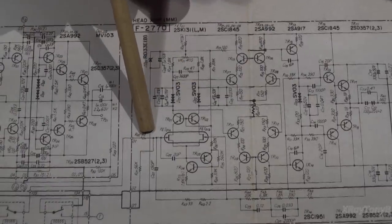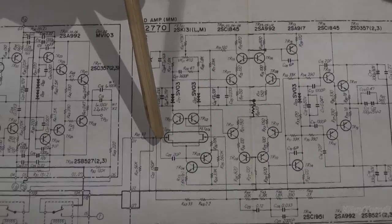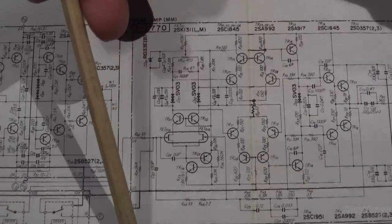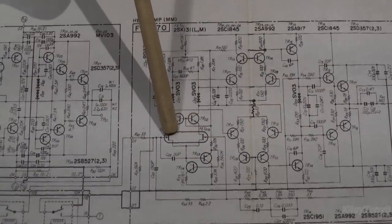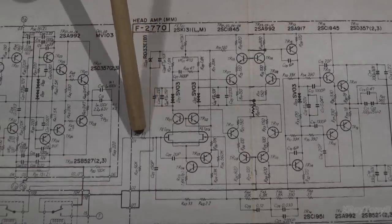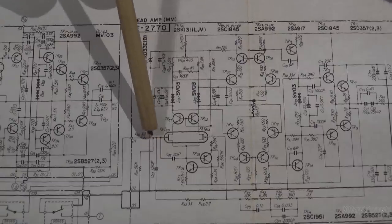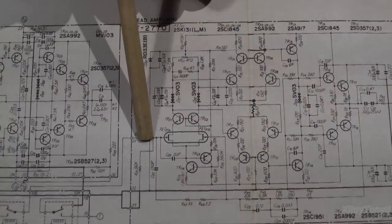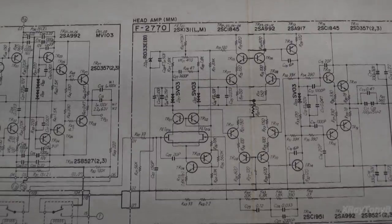What this is trying to do is eliminate the need for that by using this, which can actually be positive feedback just as much as negative, I believe. And therefore, no matter what kind of cartridge you put on this, whatever the output impedance of that cartridge is, because most of these moving magnet stages are typically designed to terminate at around 47K ohms, 47K, I believe. And this doesn't really care. It will adjust to whatever cartridge you couple up to it. So the idea is, this technically, if it works, would be the ultimate front end for a phono stage. And I think that's what that is.